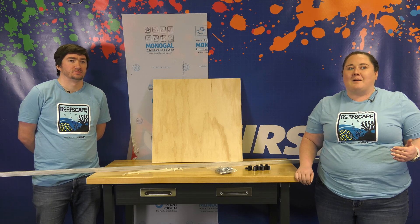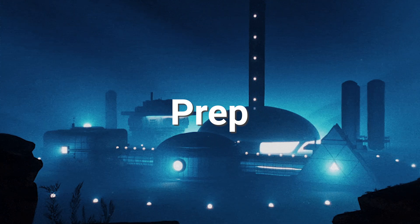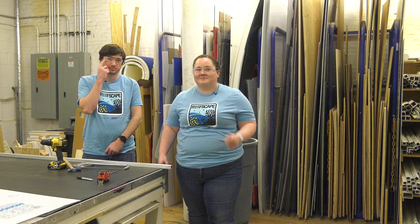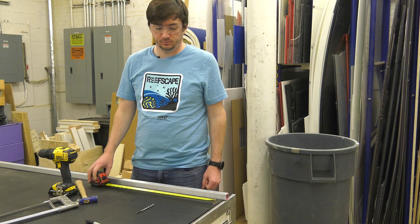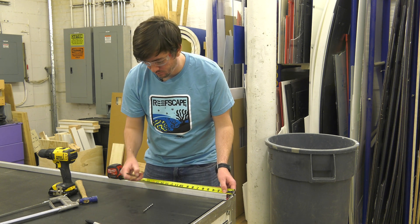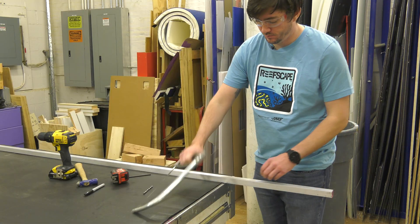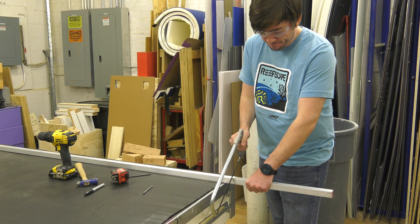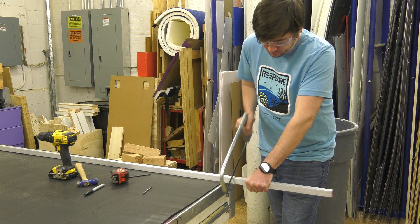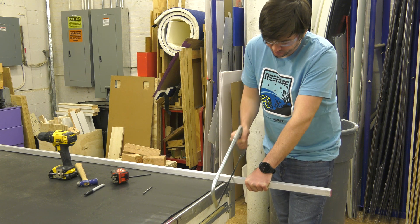So now let's move on to the KitBot manufacturing. The first step is to cut our one-inch square tubing according to the cut list provided. Let's head over to the shop. As a reminder, when using tools in the shop, you should use proper safety practices like using safety glasses, having closed-toed shoes, and tying back any loose hair or jewelry. We'll start with cutting the crossbeam to 16 inches. Take your tape measure, measure to 16 inches, and put a mark. Remember that if you're using a Sharpie, it generally draws thick lines, so make sure to align one edge of the wide line with the desired measurement, not the center. Once you have it marked, you can cut it. We're going to use a hacksaw, but teams can choose to cut this with other saws they may have on hand. When using a hacksaw, be sure to keep the hacksaw straight. Then continue and do this for the remaining items in the cut list until you have them all done.